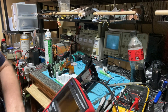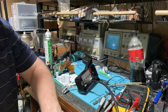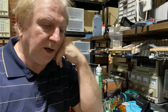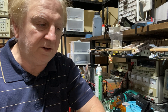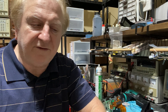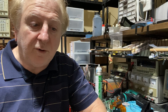I'm going to go do a kid run, it's quarter past. As far as I can tell it's a good little tool. It'd be great for doing digital work and stuff like that. I wouldn't use it for low-noise measurements, but it'll tell you if things are working. You can poke around, see if things are going up and down when they're meant to. You can measure crystals, oscillators, and all the logic stuff — it's fast enough to do that easily. You can even check ripple coming out of your car alternator, make sure all the diodes are working. Catch you later.